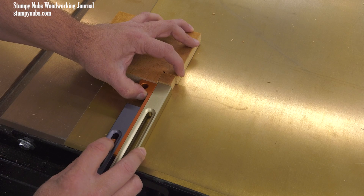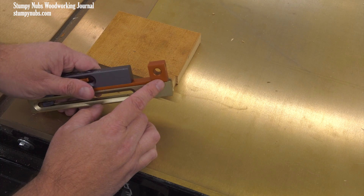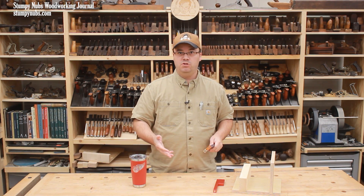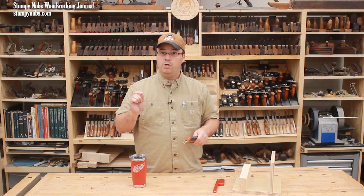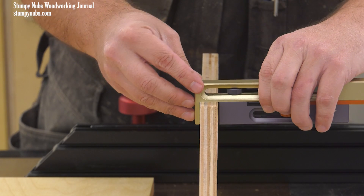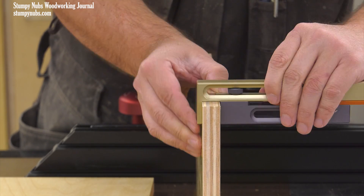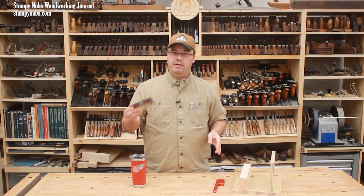Any imperfections that may add up to a loose fitting joint. So the orange portion of the tool is set to the thickness of the missing sawdust and locked in place with the orange knob. If you always use that blade to cut dados on that saw, you never have to change the orange setting again — this would be a one-time setup. What you will change from time to time between different projects is the thickness of your materials, and that is set with the gray part of the tool, merely by pinching the workpiece inside and locking it in place with the matching gray knob. That is all the setup there is.